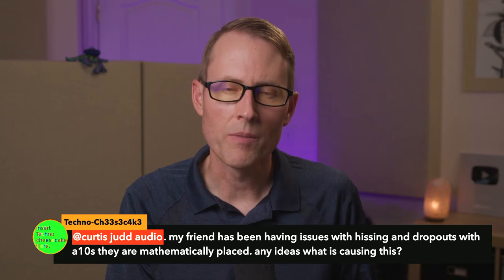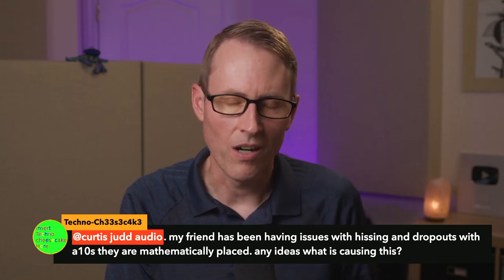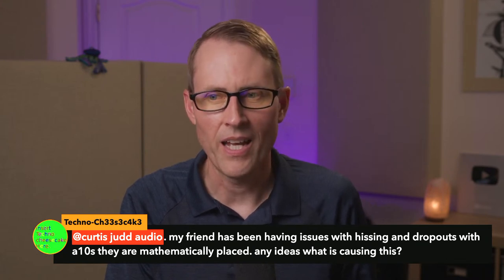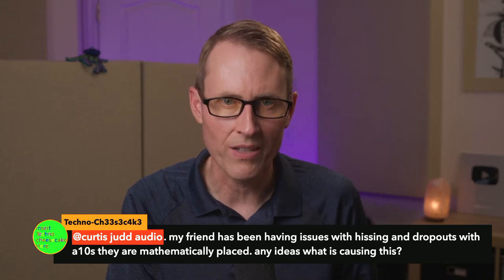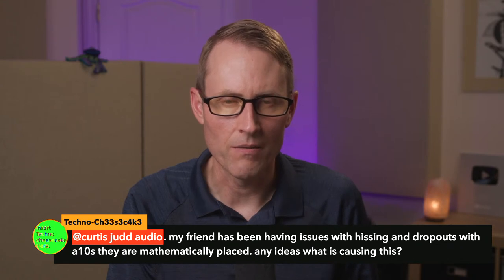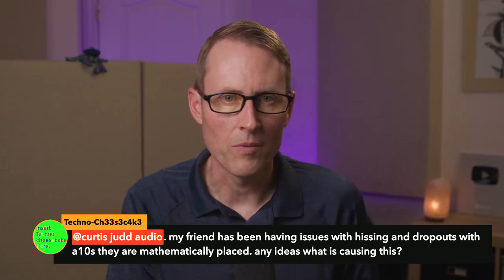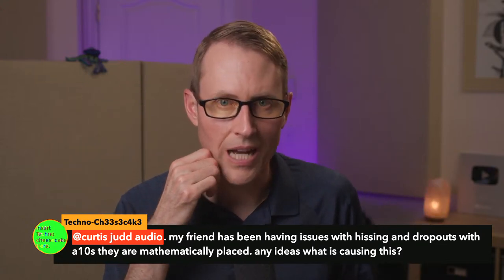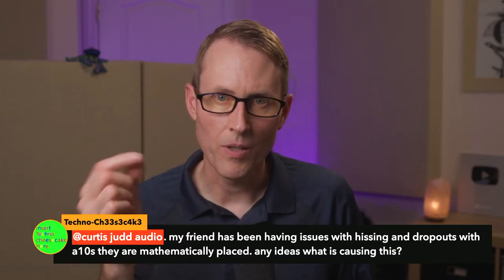It's really important to understand a little bit of wireless or RF theory so that you understand which antenna to use at the right time. And most of the production mixers I see now, if you're not just working from a bag right next to the actors, a lot of them are using some sort of third party antenna that is a log periodic dipole array, like a shark fin, or at least a dipole antenna, which again, also needs to be oriented correctly.